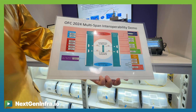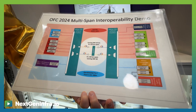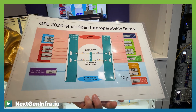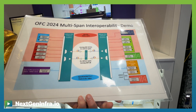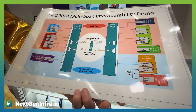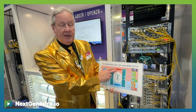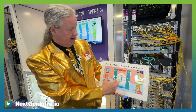My second demo is this multi-span demo — Raman amplification over a thousand kilometers. We're looking at the zero dBm OpenZR Plus MSA application. In this case, I have six more channels as well as one channel of this open ROADM application — 400 gigabit ethernet in a flexo wrapper. This is the long distance application with a different FEC, championed by the OpenZR Plus MSA and now by us in our 800 ZR work.